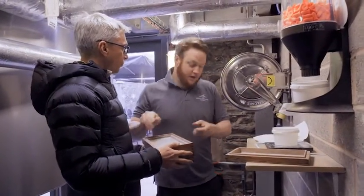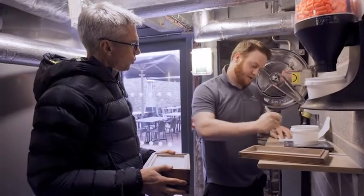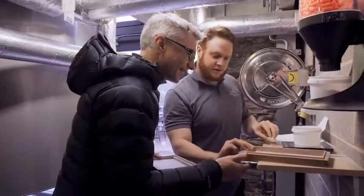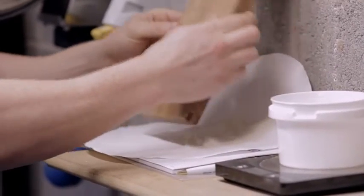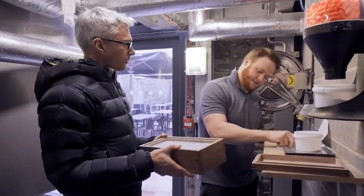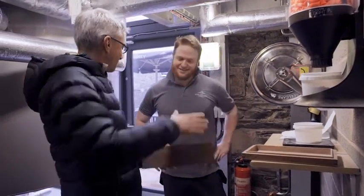And all of these are important for the process. Yeah, they're all important for the grind. We have a 20, 70, and 10 split we're looking for, so as long as we're around about that, we're happy. And the last one's the flour. Exactly 10% flour. Are you happy with that? Yeah, that's our sample done. So basically we just start the machine up again? Yeah, and then off we go. Perfect. Thanks very much. No problem at all.